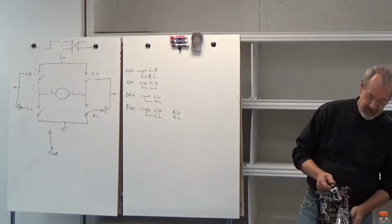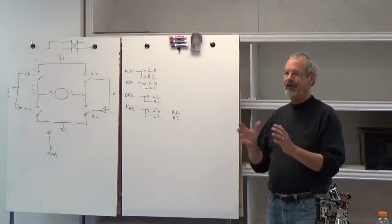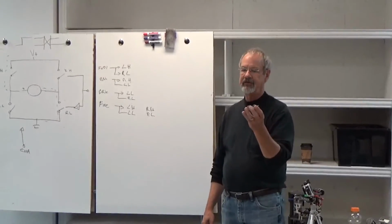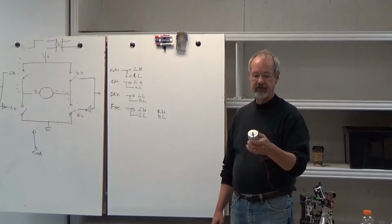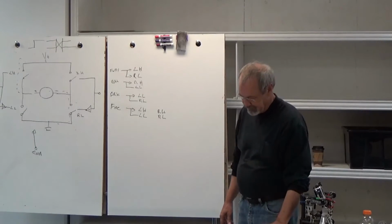It's an advantage that you go to a higher voltage because for the same amount of power you have less current, since we have current limited devices, but they're not voltage limited. So if you're going to 12 volts, you'd have to have twice as much current than at 24 volts. Also, lots of these industrial motors are 24 volts. I'm not sure why, but that's just very common.